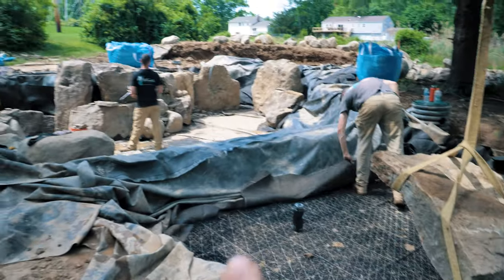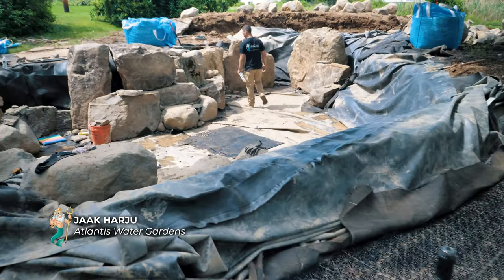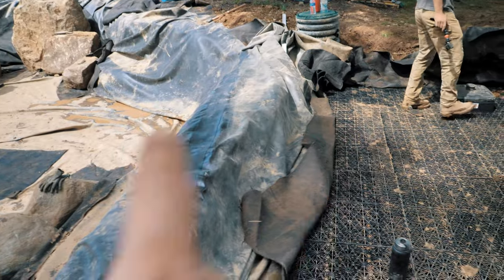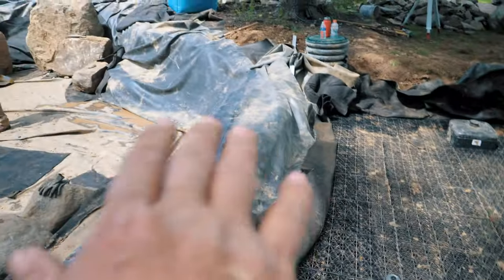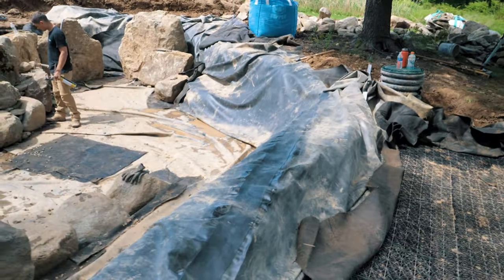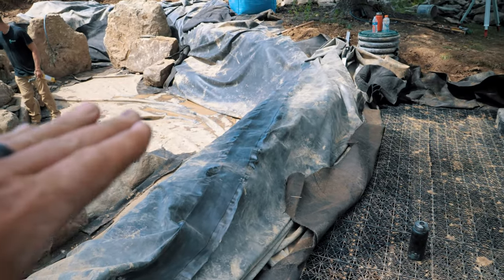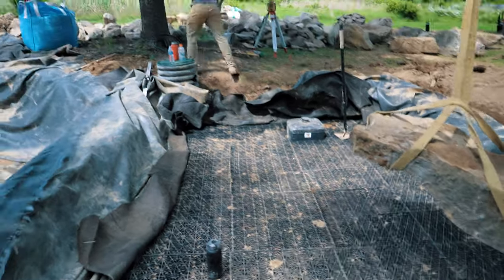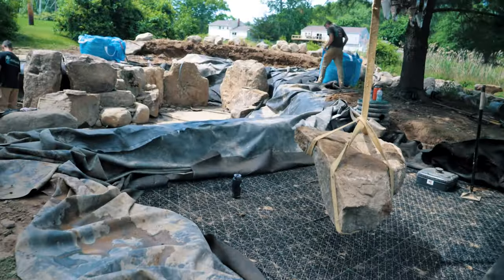We're gonna build a waterfall coming off this backside of the pond. Now, Anthony and Rob and Kevin, these guys did a seam from our pond liner into our intake. So this is a whole separate liner here that comes up underneath this 1300 gallon reservoir, meets up with the pond, and right here, there's a giant seam. So those liners are now joined as one. We are gonna have water flowing from this body of water into this body of water with about an 18 or 20 inch drop. Now in that drop, we're gonna create multiple cascades.